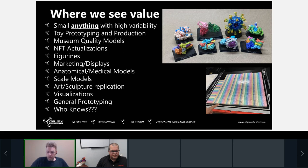There's really pretty little maintenance, to be honest. All you really need to do is clean the heads once in a while, clean out the scraper blade every 4 or 5 jobs, and load material. I mean, I'm speaking for Evelyn because she does it all, but it does not seem to be a major challenge. And even I can come in the middle of the weekend and after a very long print turn over to another very long print with no fear of failure. And that is a huge peace of mind when you have a part that's running for that long, because they are not inexpensive in terms of material cost, and usually there's a pretty tight deadline.